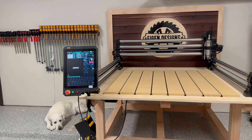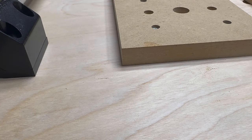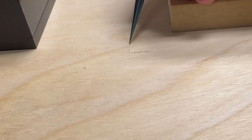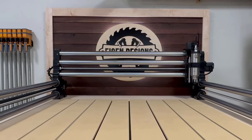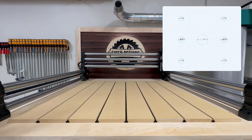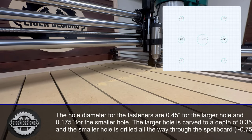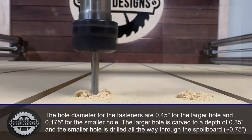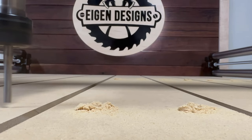With all the panels cut, I use some double-sided tape to temporarily secure the panels in place as I make the next carves. To help me find the corners I use a 12-degree bit and mark out the exact corner location of the cuttable area of my CNC. For the first carve I'll be cutting the holes that will allow the screws to secure the spoil board in place permanently. I've got some dimensions on screen if you're interested in replicating these exact dimensions, and I'll have all the screws and hardware linked in the description below.